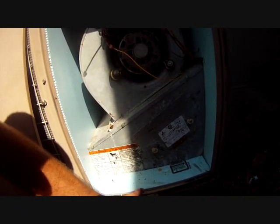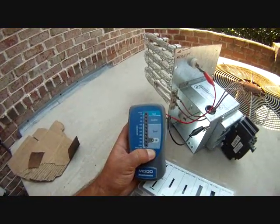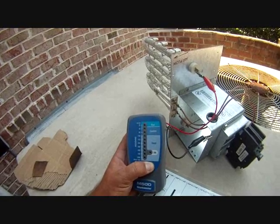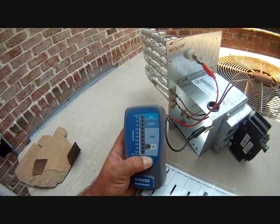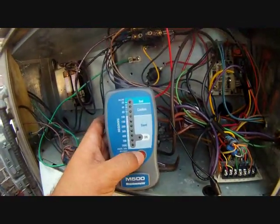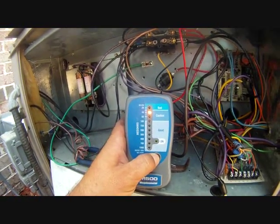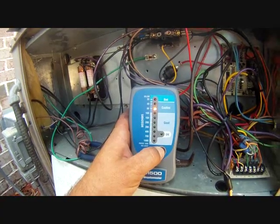The compressor was a little weak, so we're going to be looking for about 60 megohms since that's what the compressor insulation was measuring. We'll put the new heater in and see how we do. The new heater is off the chart, so it is good to go. Evidently some of the insulators had worn out on the other heater and allowed it to go to ground. We got the new heater plugged back in, lead on the contactor and one on the door. Not exactly spectacular, but a lot better than having a grounded heater. As for today, we've solved our problem — though the compressor might be headed out the door.